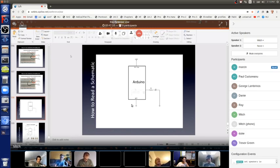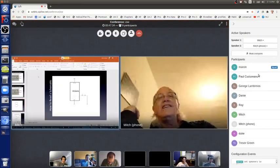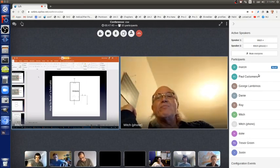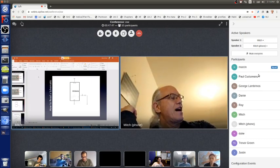That's one of them. And then there's a line, meaning a wire, going down to that weird little triangular symbol with three lines. That symbol, made out of three lines, is the schematic symbol for ground. And in an electronic circuit diagram, whenever you see that, it just means connect a wire to ground, the black wire of the power supply.